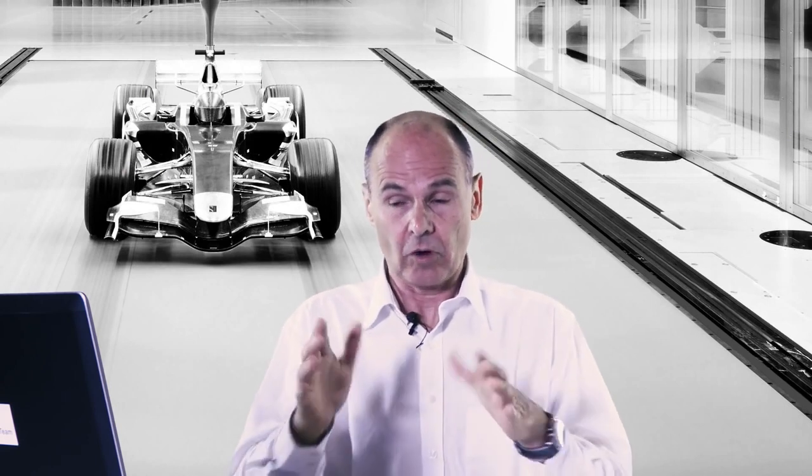Then there is another type of technology which is called contoured wall, which almost nobody uses, because a contoured wall wind tunnel would make the shape of the wind tunnel the same shape as the air would form if your test body was permanently this type of test body, with very minor changes. The air would form a certain natural shape in free stream if you're just punching a vehicle through the air, and you make your wind tunnel form that shape.